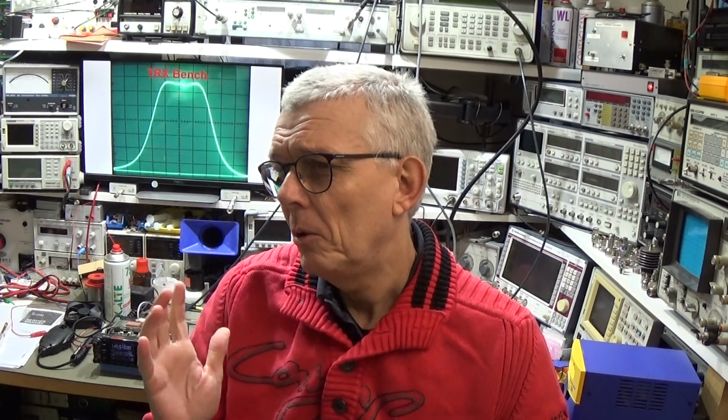But then, a couple of days ago, I had the radio, as I already told you, running beside another repair, and I just pressed PTT once in a while, and suddenly I saw on my dBm meter, as I've shown you in the last video as well, that the output signal was dropping. That was the signal coming from the main board, right? When I saw that dropping, I recognized that, of course, the output power in general was down.